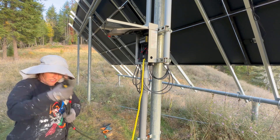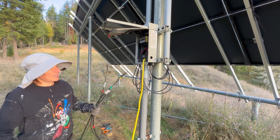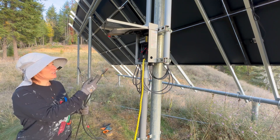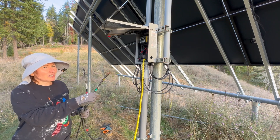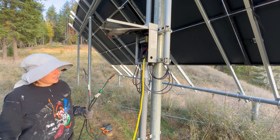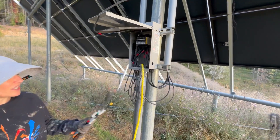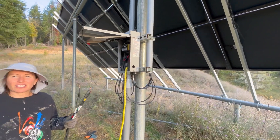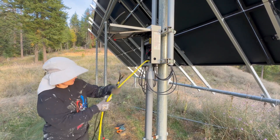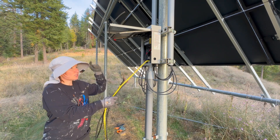Last step. We need to pull these three very thick copper wires through the conduit. We made a mistake — we should have gone with the rope the other way from the bottom, uphill, so that we have the end of the rope here. Now we've done it differently. Either we have to cut the rope, which we don't want because it's nice, or we have to go down with the wires and the rope in the same conduit. We're going to try and do the wire and the rope at the same time. We're going to tie them with sticky tape very tightly so they stay together, and then push it through the conduit.